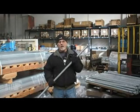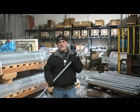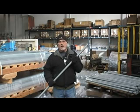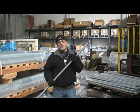This is an 1¼ inch diameter by 48-inch long galvanized F1554 grade 36 hex head anchor bolt. We just completed 356 of these anchor bolts for Caney River Substation project in Howard, Kansas. We've been manufacturing bolts like these by hand since 1912, and we'd like to take you through our shop to show you how a bolt's manufactured.